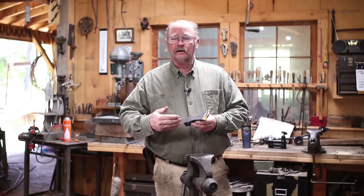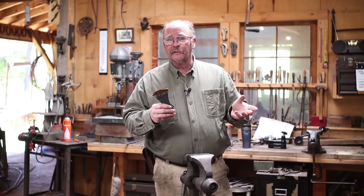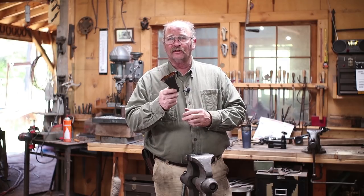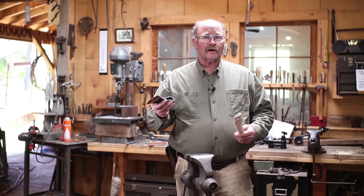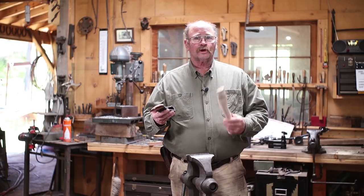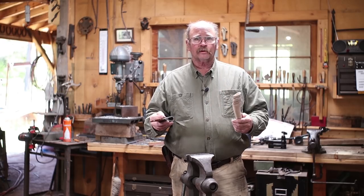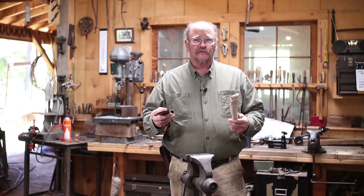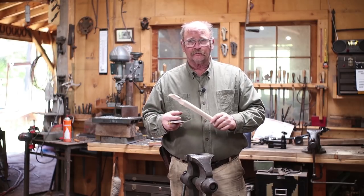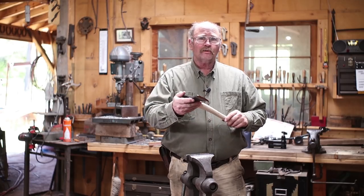Our axe head is complete. It has been hardened, it has been tempered, it has been ground, it has been sharpened, and the edge has been protected. It just needs a handle, so it's a little bit easier to swing, unless you want to swing it this way. The drift that I used is sized for commercially made axe handles. This way I can buy handles at the hardware store. Generally, I buy them in bulk from House Handle Company in Missouri, and I'll try to put a link down in the description to House Handle. I've mentioned them before. And that way I know these are going to fit.